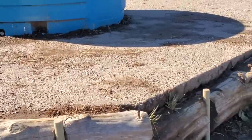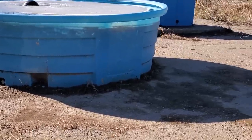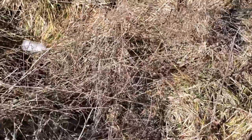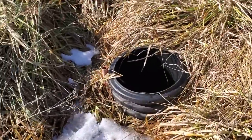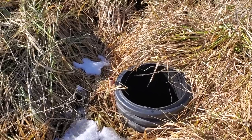This is a 400-gallon tank. We don't drain the tanks in the winter — this is central Missouri; you couldn't do this in Minnesota or Wisconsin, it gets too cold up there. But look at this — a big old ice cube on top. I just moved it; you can see the float — it's already melted away from the float. I can push down on that and I've got a valve. First thing I do when I put a pipe through a dam is put it inside a culvert, and there's a valve down in there.